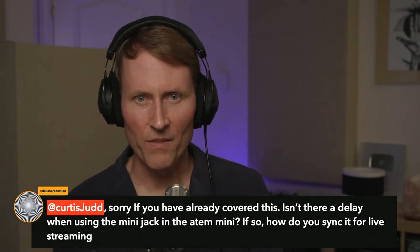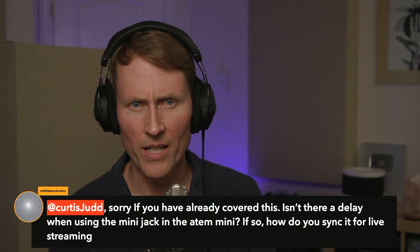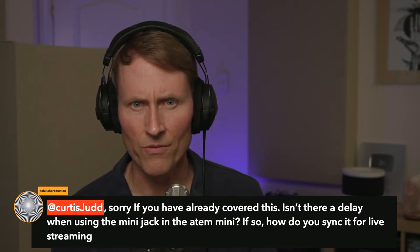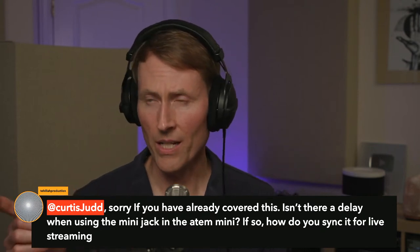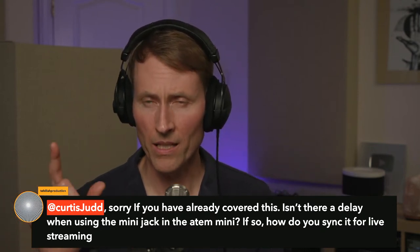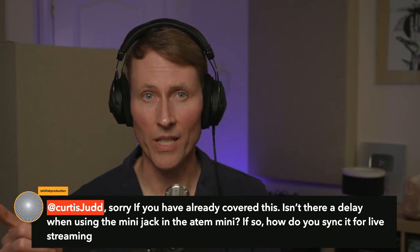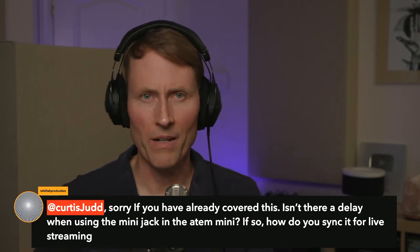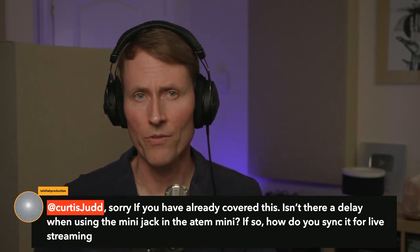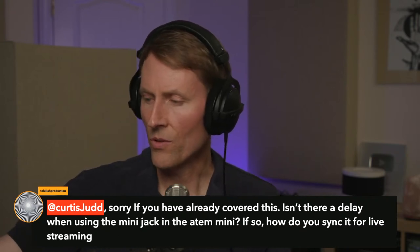Sorry if you have already covered this. Isn't there a delay when using the mini jack in the ATEM Mini? If so, how do you sync it for live streaming? We did cover that, but let me just say again, the ATEM Mini and the Mini Pro and the Mini Pro ISO now have an audio delay feature, so you can get it back in sync. We kind of ran through how I went about doing that just a few minutes ago. But in essence, what you do is you use something to record.